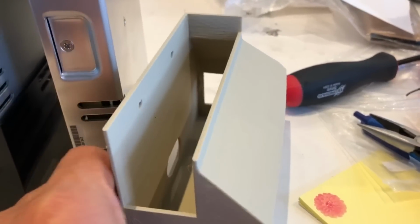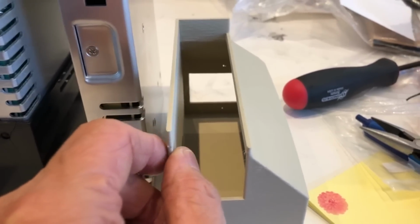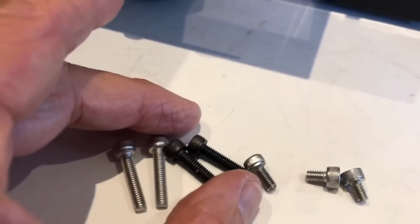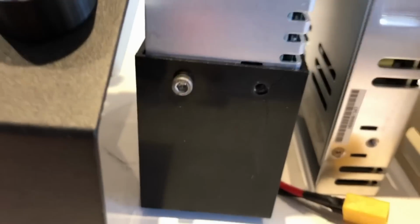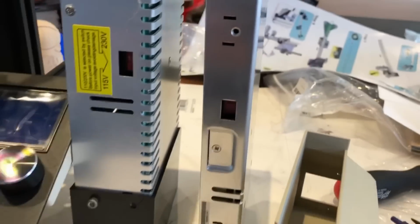And the gentleman that designed this made some comments about changing screw size. So for the frame, I'm changing from M20s to M16s. So this is where it connects to the actual gantry right there. Then you see the screw that I pulled out, that's an M8. So I'm going down to M6s because this is going to be attaching on the side. And obviously with a streamlined machine, you still have the same electronics inside, so there might be a chance for a screw hitting something and shorting out. So I'm just playing it safe.